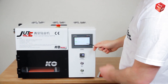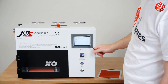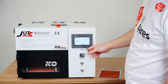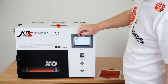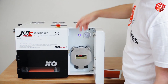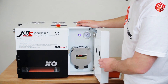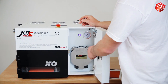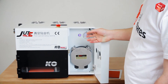Now let's go back to the autoclave. The display shows that the time we set of three minutes is coming to an end. After the set time is over, go back to the main menu. The display will show the notification bubble 'finish.' To release the pressure, press the button on the display or the button above the autoclave. Never open the autoclave doors before the pressure is released. This device does not automatically release pressure.